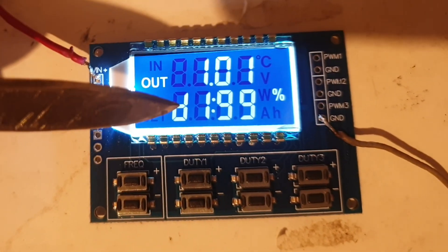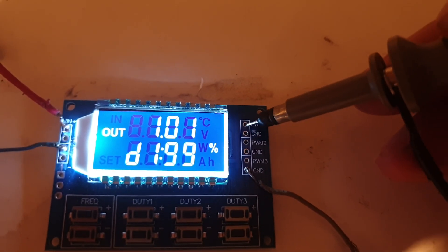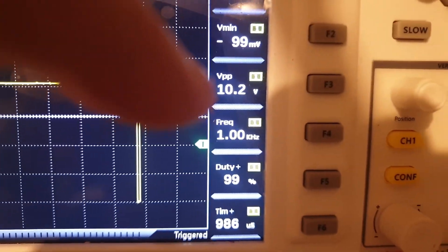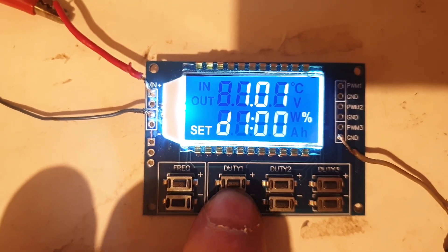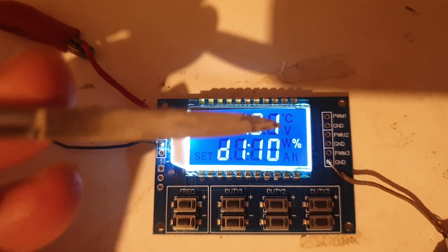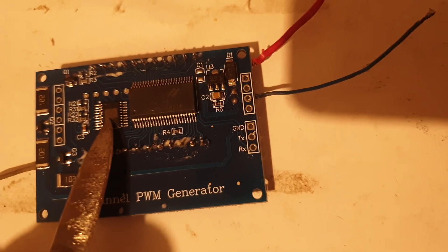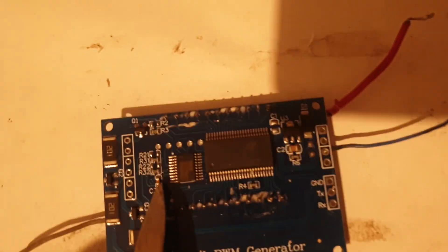The square labeled D1 means duty cycle, channel 1 — currently 99%. Let me probe PWM1 and confirm. The oscilloscope confirms it's 99% — mostly at 10V with small negative spikes. The display shows transmit and receive data labels, probably for serial communication with a PC or another chip. The markings on the main chip have been laser-erased, but I found the original picture from other sellers — it's an HT1621B from Holtek, which is an LCD driver.